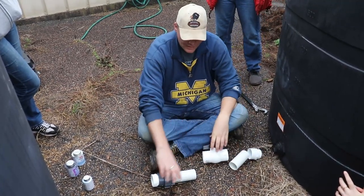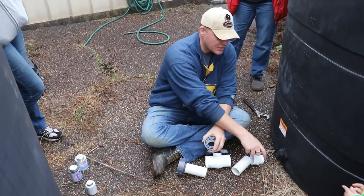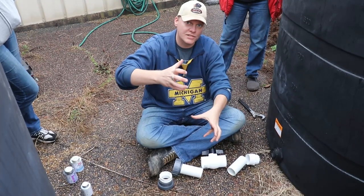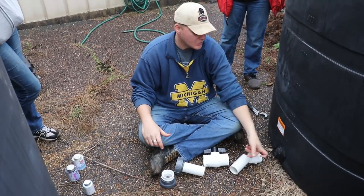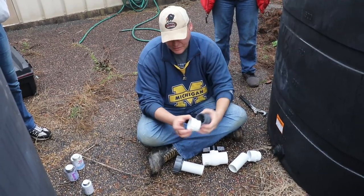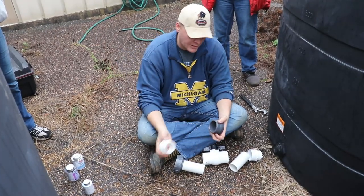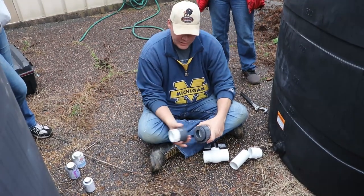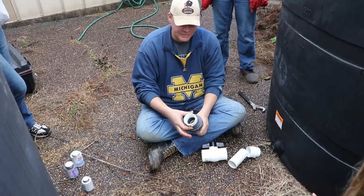That's what we have here. Then the other issue we're having is that the tank or the suction, we want to suction off the bottom, because the last times we tried doing this with the IBC totes, we'd stick the green tube for the suction in and it's got such a coil that it wouldn't go all the way down in the IBC tote. So I want to suck it out of the bottom, but it has a male connector on it. And if we were to stick that in there and rotate it, it doesn't swivel independently, so we'd have to rotate the whole hose. Anyway, to make it simple, we got this little joint coupling. So I can put it here, and I can just swivel this guy instead of having to swivel the whole hose.